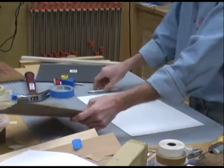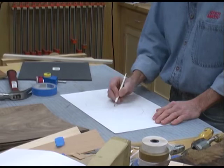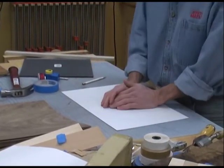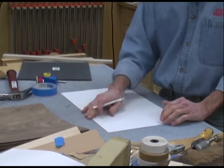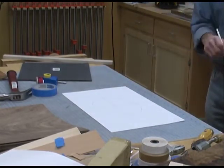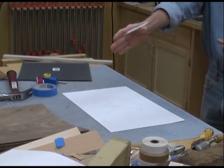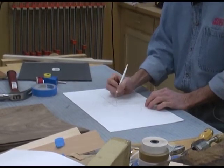The one people really get the biggest kick out of is a radial match — where you take a table and have pieces of pie that all come in and meet at a point. To do a radial match, you need however many pieces in sequential order. These are called 'ways' (W-A-Y-S). A four-way match has each piece cut at 90 degrees; an eight-way match at 45 degrees; a twelve-way match at 30 degrees.